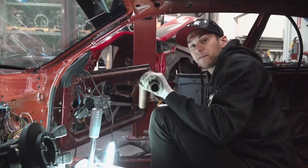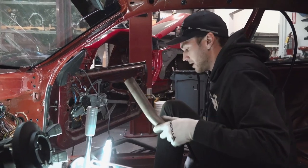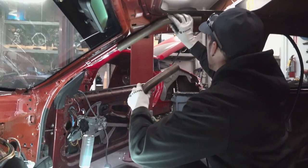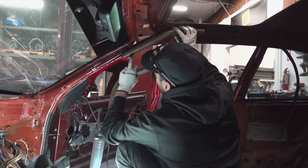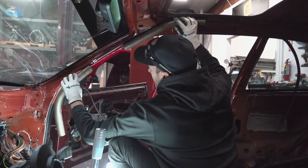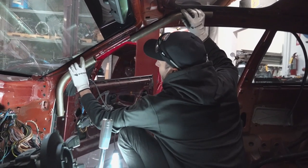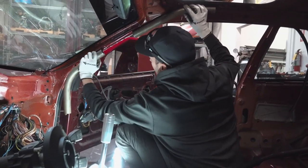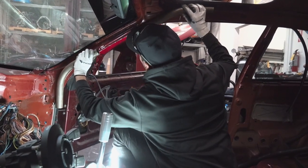Then you have to figure out how to offset your two tubes, and that's where it can get a little tricky. I've simplified it in a way that's fairly easy - you hold both of your tubes up at once right on your marks, then draw a straight line down these tubes. I ended up using this longer one from another build. It helps to have another set of hands, but you just try and line up an imaginary line with these tubes as best you can, and you can see that line is pointing right at that one pretty well.